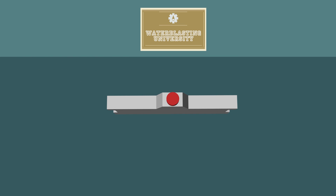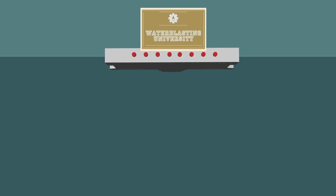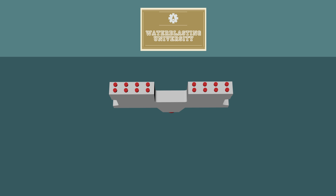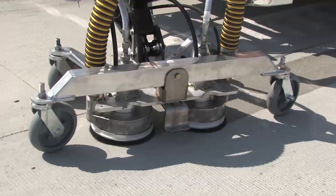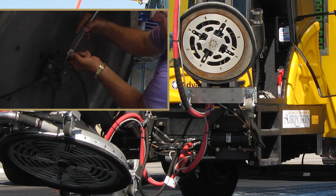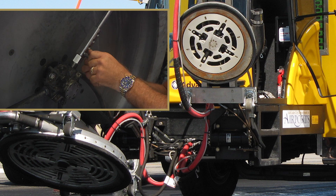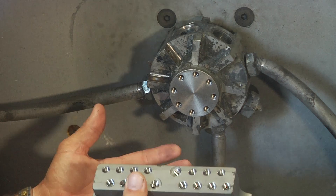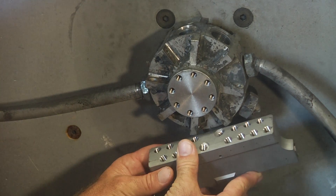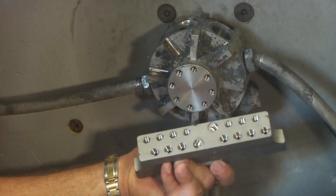Here's an 8-inch spray bar that is quite aggressive — you would only use this for removing heavy thermoplastic or epoxy markings — while here you see an 8-inch spray bar with a greater number of nozzles for paint cleaning or cure compound removal. Notice you are completely unable to change spray bars on the Cyclone head. In fact, it is very difficult to even change a nozzle out if it's worn, because the nozzle extender may come loose from the spray arm and you cannot reach it with a wrench. Here you can understand how it's impossible to create a narrow width with the Cyclone head — the entire central hub occupies the space which you would need to put jets in.